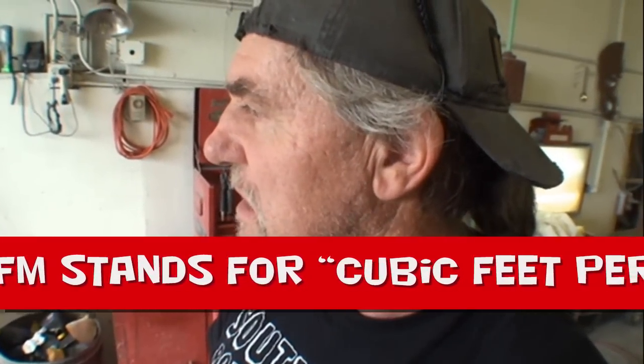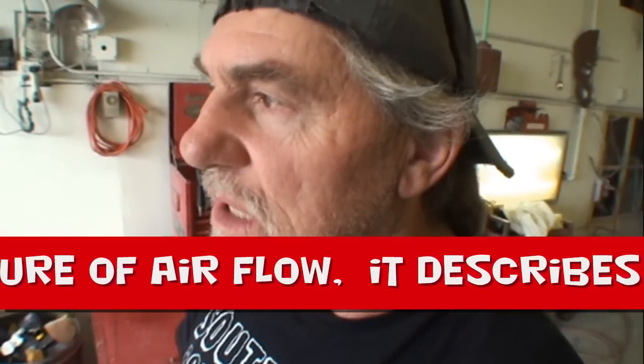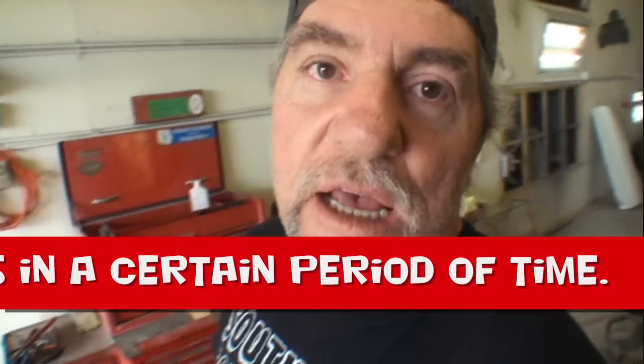And when I talked to the compressor guy, he said that it would probably be worthless to fix that machine because the output on that, the CFM on that, is only around between 18 CFM and 23 CFM. And my Big Bertha compressor, which is our Campbell Hausfeld compressor, puts out 28.5 CFM, and that's really what I need. The CFM is what really counts when it comes to the compressor situation. And let's go get our motor, let's check it out, because we got to get this thing hooked back up. We got a car to paint today.